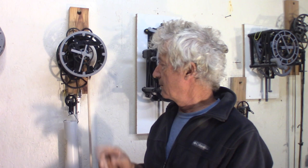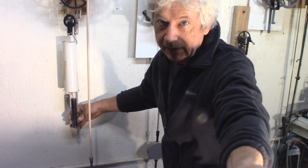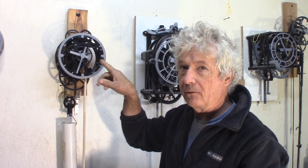Hey guys, Shark here. I'm slowly making progress with my 8-day clock. This one's been running about six weeks, but lately I just had to add that extra 500 grams because it stopped working. I'll have to take the clock apart to find out what's happening, but I think one of the shafts moved back and it's rubbing against the frame at the back, slowing the clock to the point it stops.